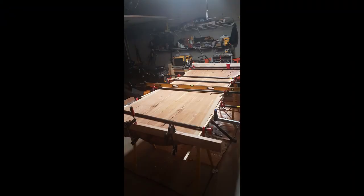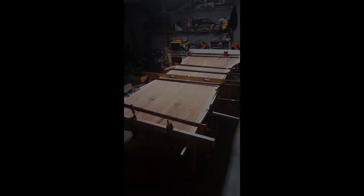So the day rolls around and it's time to join the slabs together. I don't have much video or pictures on this process, but if anybody has any questions on what I used to join them together, I'll be happy to give you information. It wasn't too difficult, actually — I'm really pleased with the way they joined together. I used half-inch dowels to join them together and clamped it up. I used a jig to drill out for the dowels — it was actually made for 4x4 posts, and man, it worked out perfect.